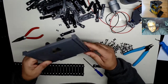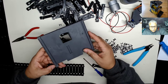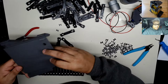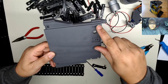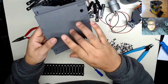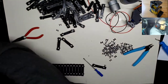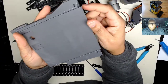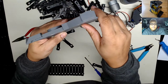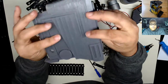For these panels for the body, this one I didn't do with brim on the inside. I just did brim exterior and no supports, so I have a little bridging issue here. And the reason why I decided to do that is the same with this one. I did no supports. You see how nice and clean it is. Everything's clean. But for this one, I said support everything, but I blocked this out. I did this in Cura 4.1, blocked it out so it didn't put any supports in here. But I do have a little bed warp there. But this one, I said support everything, and you can see it created supports in here, and I had to clean it out, and that's unnecessary. So I still had to do a little bit more cleaning to it, but it's unnecessary.